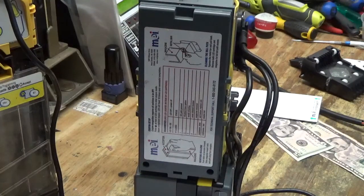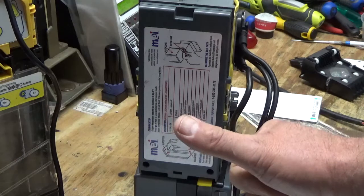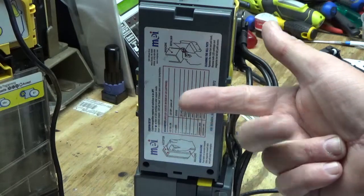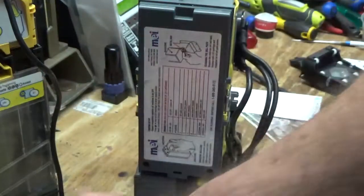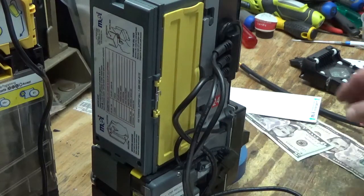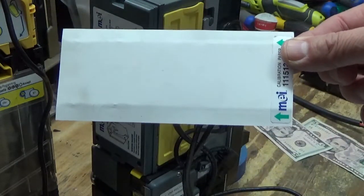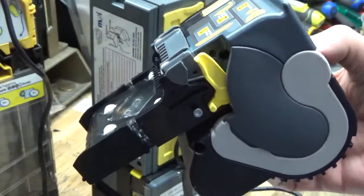And don't be intimidated. It's a little confusing at first, but the main thing you want to do is set up the currency size, whether it's $1 or a 5, the capacity. 25 is standard. If you have installed a new lower transport assembly on a standard, just regular 2700, you have to calibrate it the first time or it will not work, and that's what that calibration card is for. We have these listed as an option when you buy a rebuilt recycler component. Okay, you can buy the card. They're only about $5 or $6.